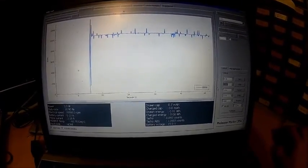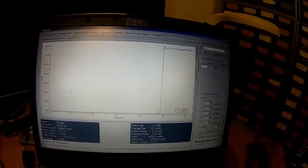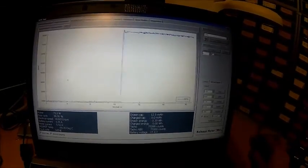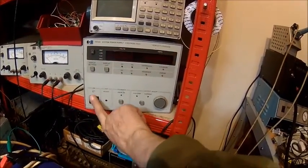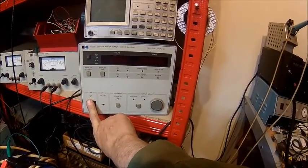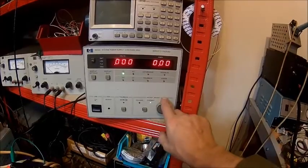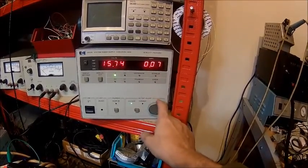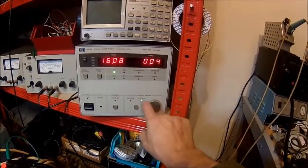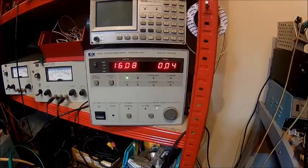So if we go to 80,000 electrical — that's about 10,000 RPM — it just goes there straight away. The power supply had an overvoltage shutdown, because if you brake too fast the ESC is actually regenerating back into the power supply. That power supply is just a bit too twitchy and doesn't like that. So we're going to set it again: we want about 15 volts and a lot of current. Our current limit is 20 amps and the voltage is 16 volts; I think it runs down to about 11 or so.